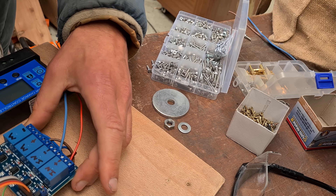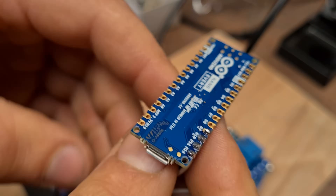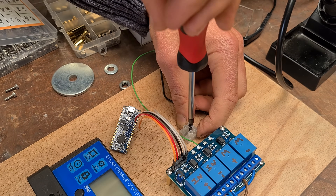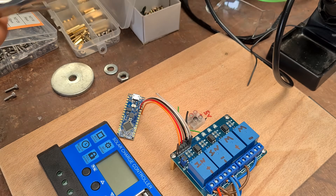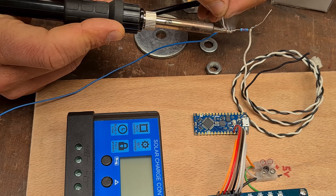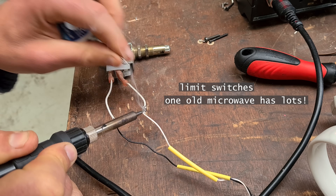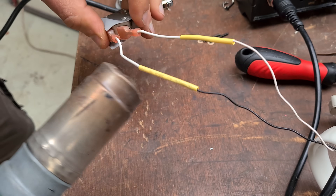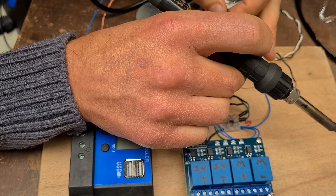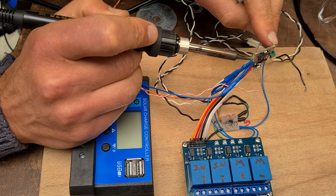In case you're unfamiliar with Arduino, all you need to know is that it's like a little computer — it can take inputs like the light sensor and be told to output signals based on them. The cool thing about Arduino is that it's cheap and super easy to learn. I'm going to be quite snappy with the soldering so that the resistor doesn't take any heat damage. The last thing to solder on is the manual switch — it's become rather awkward. Spending some time getting proper holding apparatus would be sensible.